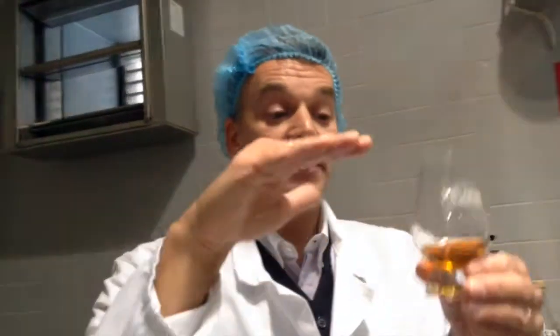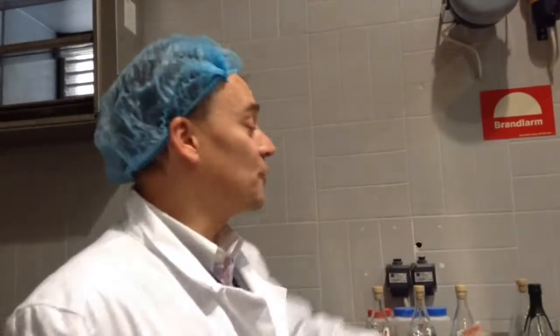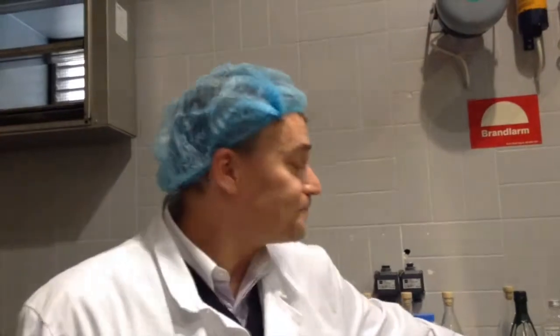So to make this into a vodka, a gin, or an aquavit, we actually take it out from the oak, we cut it back to about 40% alcohol, and then we infuse it with herbs, botanicals, we macerate it, sometimes we boil it out a bit, let it rest, and then we distill it, and we do that in the spirit still. So if we're going to do an aquavit, for example, we infuse it with caraway and some other herbs and citric fruits. If we're going to do gin, we obviously add on junipers, coriander, and so forth. And then we get a clear liquid, because obviously all the color is lost in distillation.